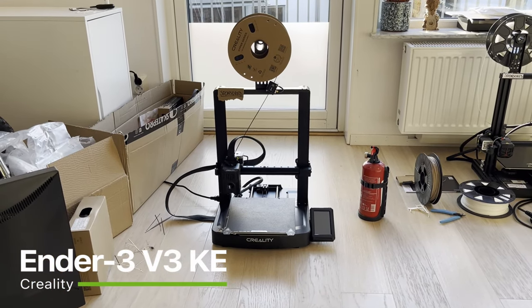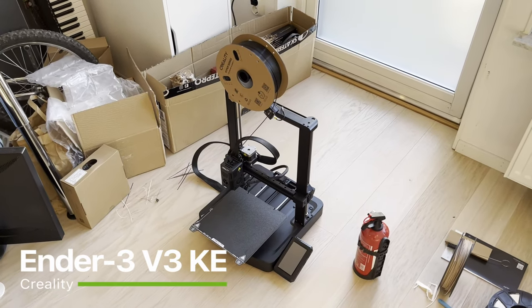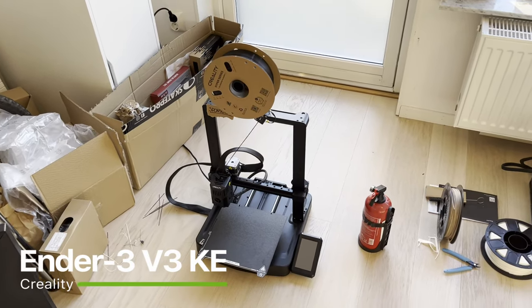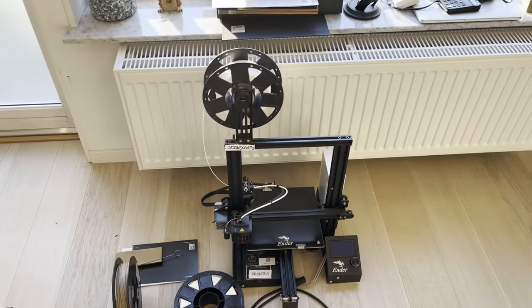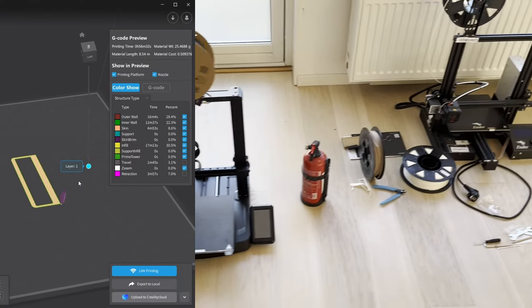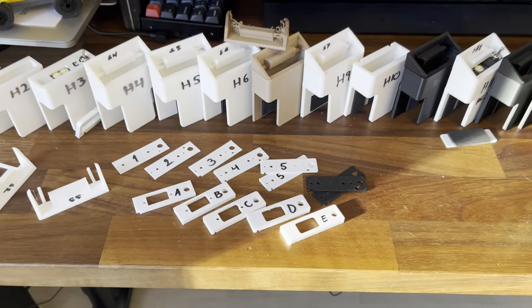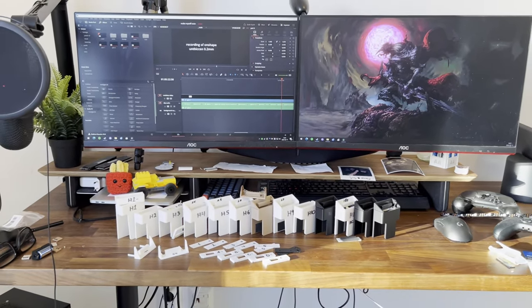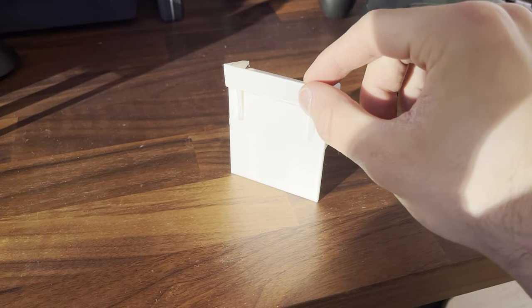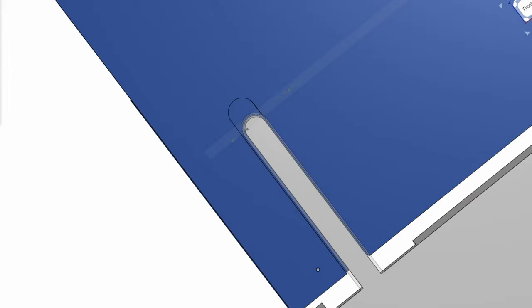Usually people skip through sponsored segments, which sucks, because this printer played a huge role in how I prototype things. I don't have any talking points, so I'm just supposed to showcase it — I hope you stick around because you'll miss parts of the story otherwise. Comparing to my old printer, this holder takes about two and a half hours to print, but with the new one it takes just an hour. It moves and prints so fast I had to put it on the floor for stability. One unexpected problem: the new printer was a bit too good — I had been counting on prints coming out a fraction of a millimeter larger than sketched, so I originally made connecting sticks 0.2 millimeters thinner. Going forward, I didn't need to account for that anymore.